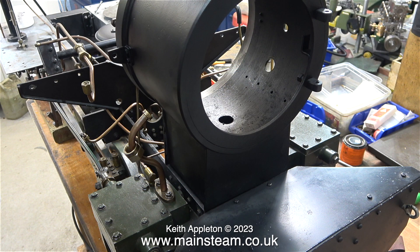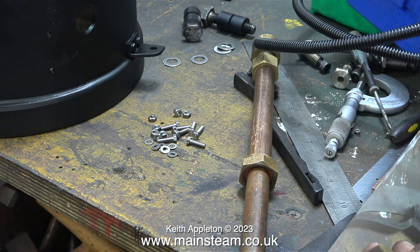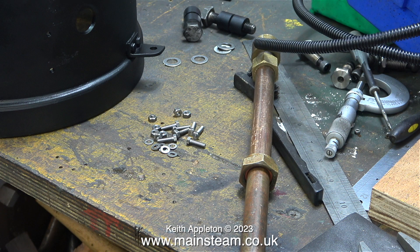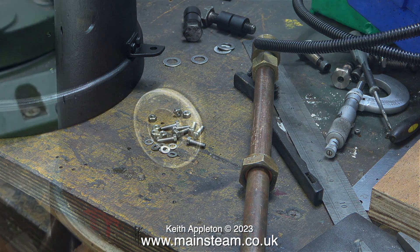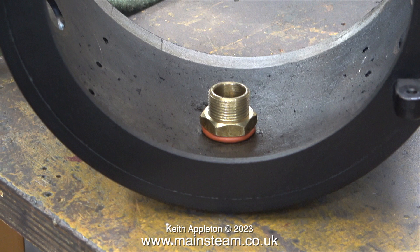There are quite a lot of things to do in this episode, but the good news is they are all easy jobs. The first thing I did was sit the smoke box on the saddle to make sure it fitted. I initially did this to check that the bolts go through the saddle into the smoke box. The part I worked on in the last episode I now need to fit to the smoke box — it's a threaded guide for the blast pipe, and this is where it goes, right underneath the smoke box. On the other end of this fitting inside the smoke box there's a silicone O-ring, and the nut is not a tight fit, so it was very easy and simple to fit this part in place.